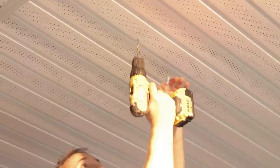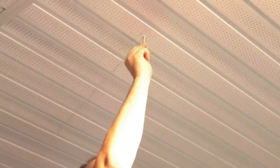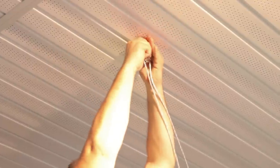Upgrading the old pigtail bolts is straightforward enough. Just disconnect the pulley, unscrew the pigtail, drill out the hole to the right size for the new bolts, screw in the new eye bolt, and reattach the pulley. I also made sure to orient the direction of the eye bolt in the direction of tension of the pulley — that way there are lower shearing forces.